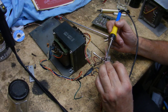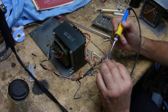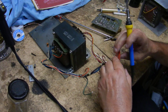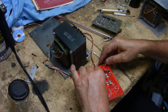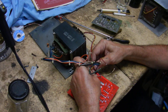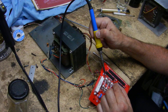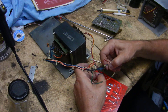I'm doing it backwards now - I'm going from where I ripped the last ones out, repopulating them. If you notice the solder is not flowing properly, it's because there's a large ground plane and the heat is dissipating away from the iron into the board. The track is thicker there, which means the solder and heat dissipates into it. This yellow one goes here - stick it through the hole. Clean the iron, get some fresh solder. It's 60/40 - don't use lead-free, you're wasting your time. That stuff is disgusting, it should be banned. So we've got the blue - stick the blues over here.